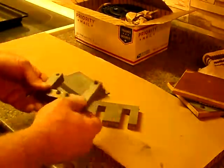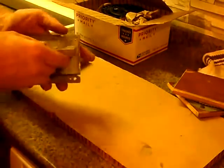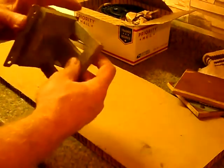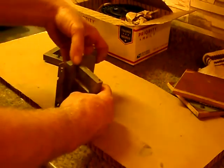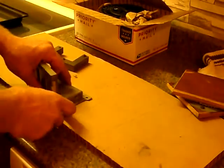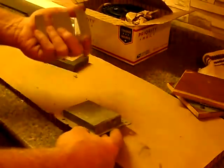And then I took this. First of all, you have to know that this microwave transformer is like this, right? And it goes all the way across, and you've got a lot of area there. But you have to grind this edge where the weld is. There's a weld on there, and you grind that off with a die grinder or a little tiny grinder on each side. One there and one there on a line all the way across, and then this comes off.